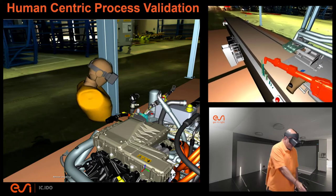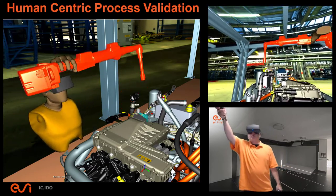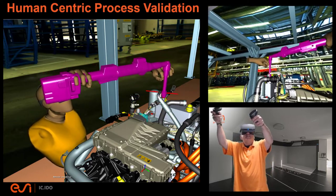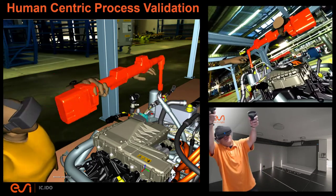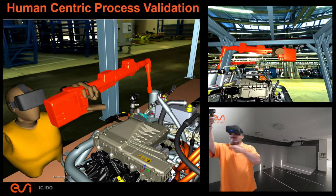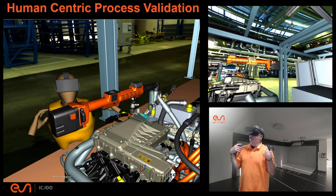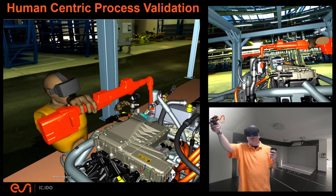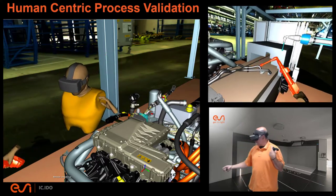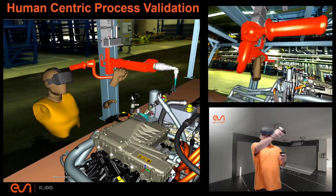It's probably a good idea to grab one of these extenders and attach it to the tool. Fortunately, I have another version of that tool with an appropriate length extender already on it. With two hands I can guide it into place, but it's still not easy to see from this vantage point. I'm holding the tool further away from my body and up above my shoulders, which human factors engineers and ergonomists say is a bad idea — we'd be getting poor scores on the RULA or the EAWS ergonomics assessment.